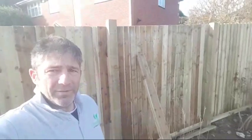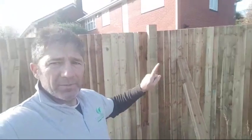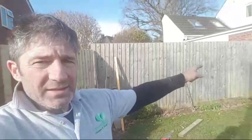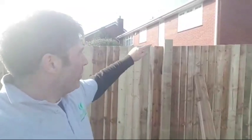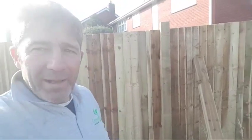If I come back over here, if you look at the fence as a whole now, you'll be able to see that every 1.8 metres I have these four inch by four inch posts. I've introduced them into this side of the garden because there's trees and shrubs next door. The reason I introduced the posts into a fence run on this occasion is because when you see a fence like this it's very commercial and not ideal for a domestic situation. So I've introduced the posts as we go on and then alternated the feather edge boards on each panel, giving a very ornamental look. Then I'll cut the tops off those posts and put a little finial and a cap to make it look a bit more ornamental and personalise it.